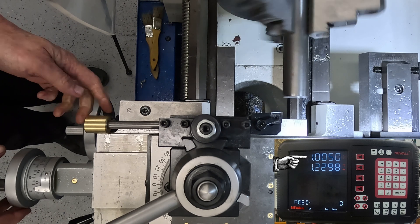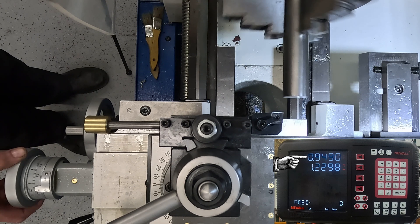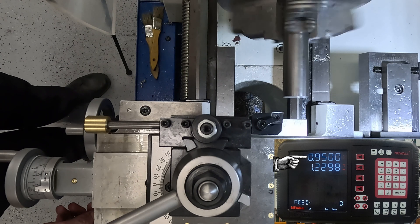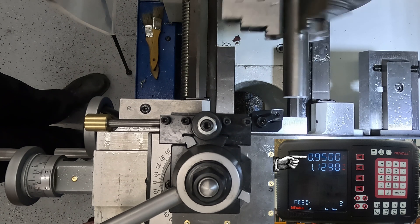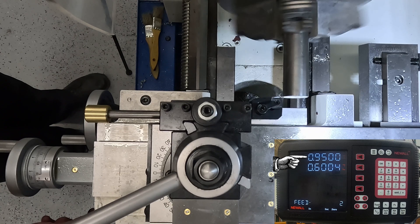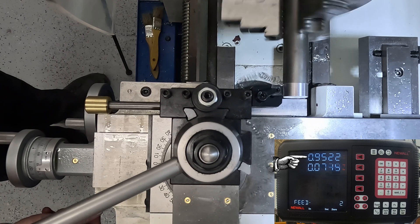I'm going to go in 50 thou with the lock off. All right, 50–55 thou, starting the automatic feed. With no lock and only a light cut, you can see how the cross slide is pushed. With heavier cuts and larger diameter parts the effect is even more dramatic.